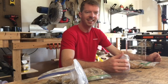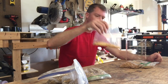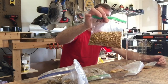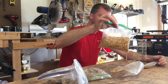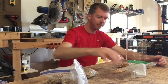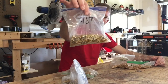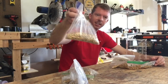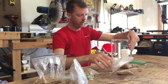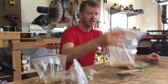Welcome back to my channel. It's an extremely hot summer day, but today I'm going to knock out my pins — supposed to be part four of the computer scrap. I've got three bags of high-grade military-grade pins that should have a thicker than normal gold plating. Over here I've got some lower-grade gold-plated pins. I'll do the high-grade separately in one batch and the lower-grade ones separately, since I expect a lot more base metals in those. So we're going to get started on our high-grade pins, get them all into our beaker, and start dissolving away all the base metals with nitric acid.